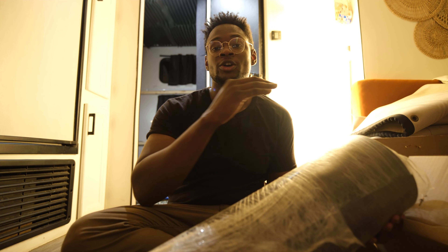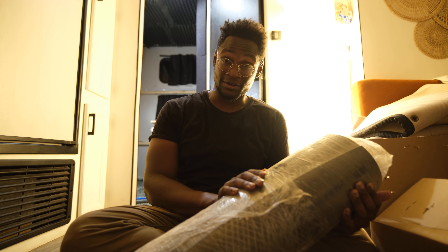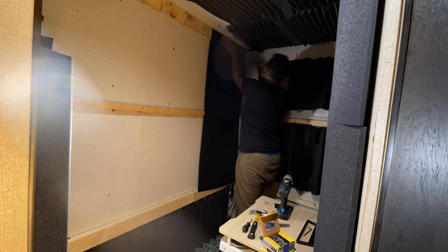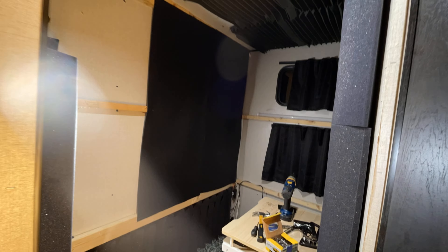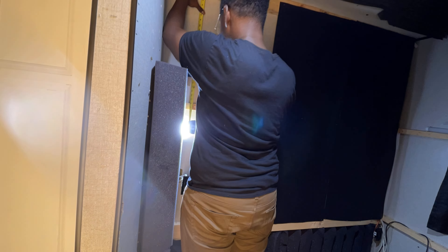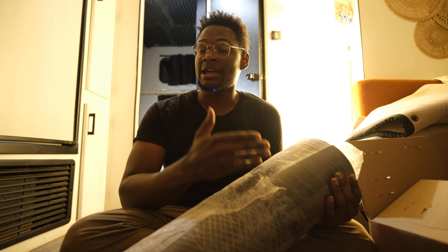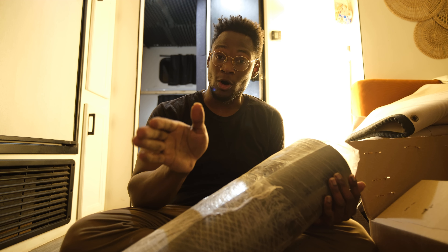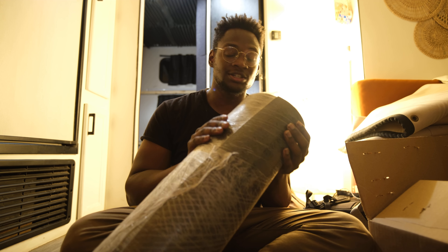What this is going to do is prevent sounds from entering or exiting your actual space — this is what's necessary for soundproofing. Most of this video is going to be done in voiceover and you'll see me working to get this stuff on the walls. The first step is to hang this onto the walls. If you can get it away from the walls by adding studs to create an air gap between this and the first wall, and then another wall to the outside, you're going to get the best bang for your buck.